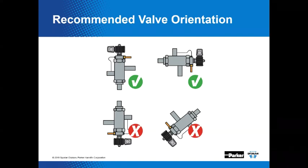We don't want a lot of oil and contamination getting inside that enclosing tube either, so that's another reason to install them in these kind of positions. That's correct. Now, in our installation instructions, we talk about vertical and horizontal orientations, but sometimes people can get confused by that. So that's why we've depicted it as we have here on this slide. Like I said, a picture paints a thousand text messages.